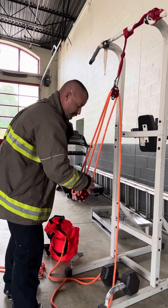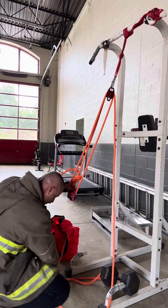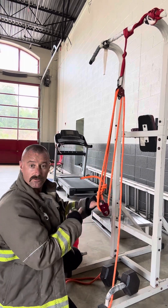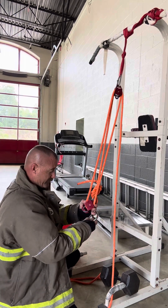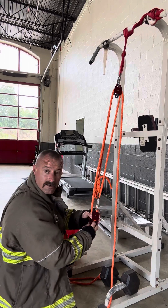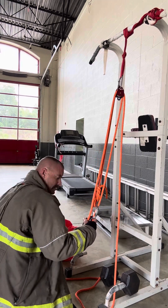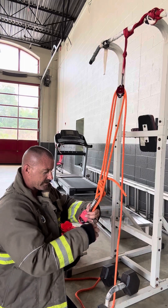You don't want to cross these ropes up. You've got to figure out where your knot needs to go and be mindful of which side your rope is on the pulley so you don't cross it — if you cross it, it's going to be messed up. So you take your hook, put your knot on there; it goes on the bottom because it's a three-to-one, odd number goes to the bottom.